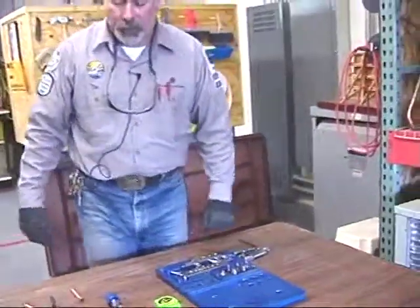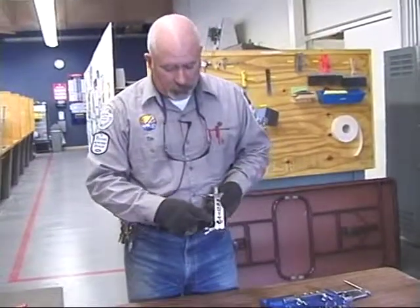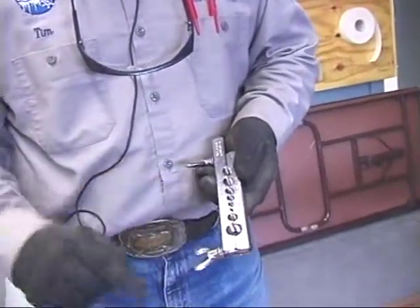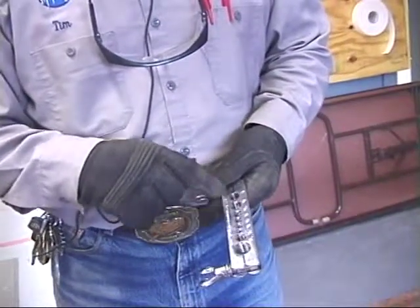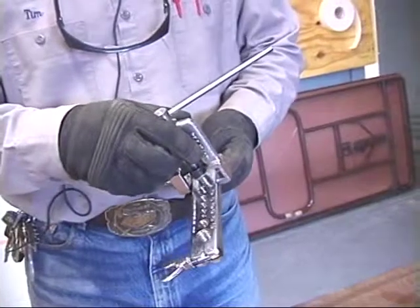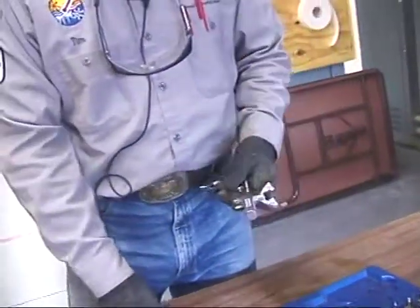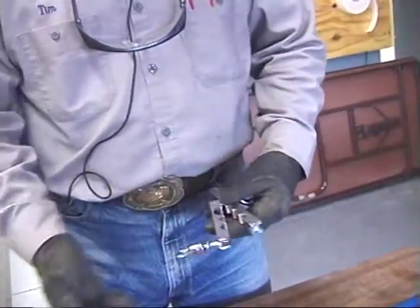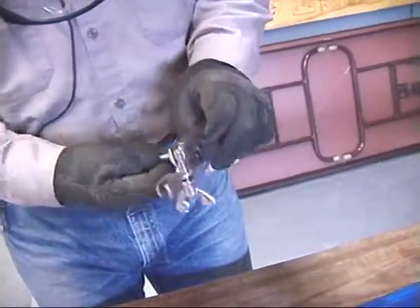Once that's accomplished, you're going to set your vise into place. Remember, the side that has the indentation is for flaring — do not, and I repeat, do not use that for swaging. For swaging, you have to use the proper hole on the flat surface. Also remember that in some cases your yoke will not fit onto the clamp because of the wing nut, so when dealing with half inch, use the second vise. Flip it over and open it up. Be sure that the threads are clean — just rotate your wire brush to pull all that out.